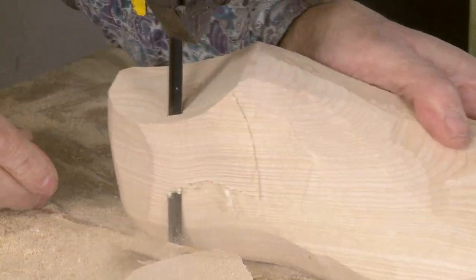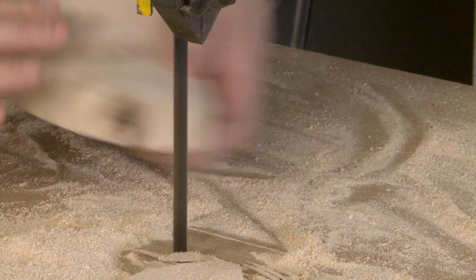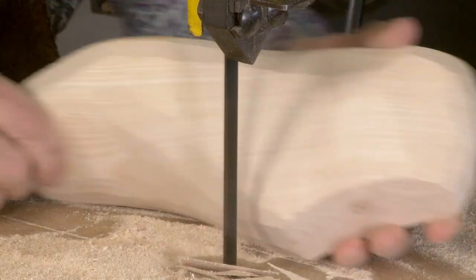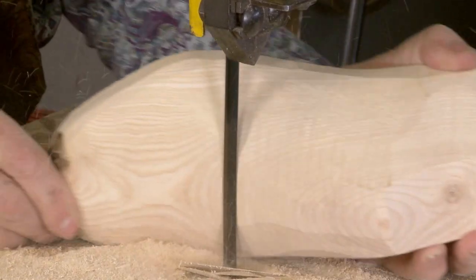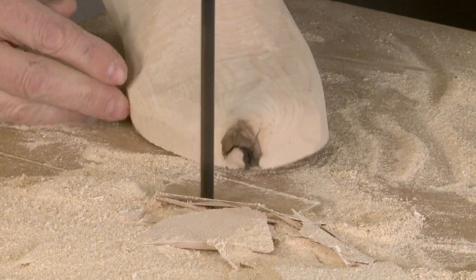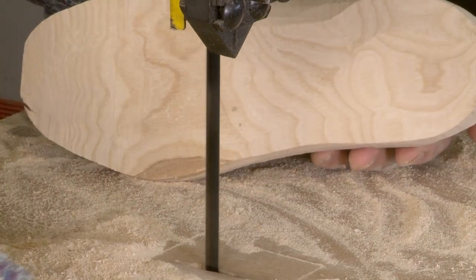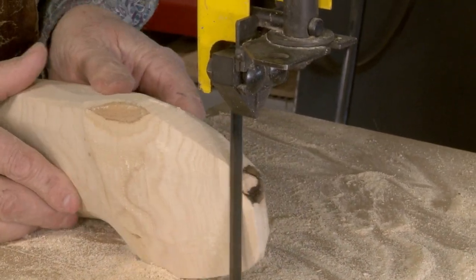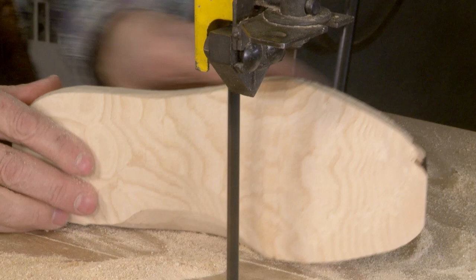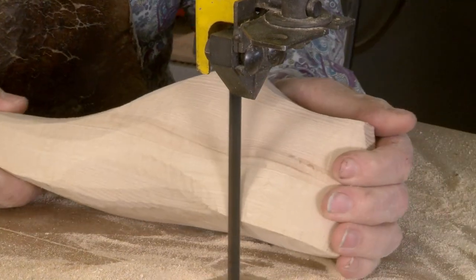And so that's the trick, is to learn to move the wood through in smooth flowing shapes that create contours, and only taking off 1 or 2 millimeters at a time. You've got plenty of time, it's fast, you just keep moving. And it's effortless. You don't let the blade do any work other than just remove the surface of the wood. And that way, gradually the shape emerges. The mistake people make is trying to go too deep and doing too much in one cut. And you don't need to do that. You just skim in, skim in, skim in, and you get there in four or five cuts just as fast as if you tried to do one cut all at once.